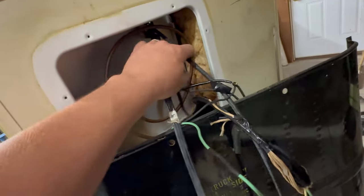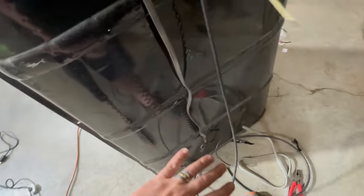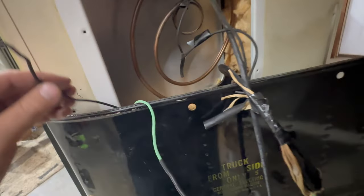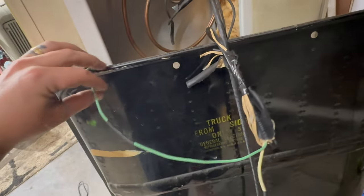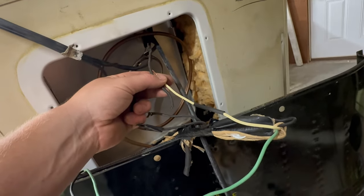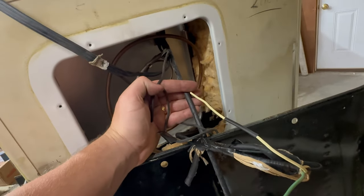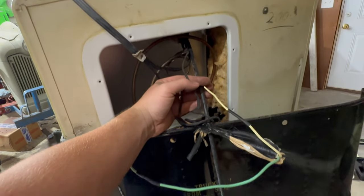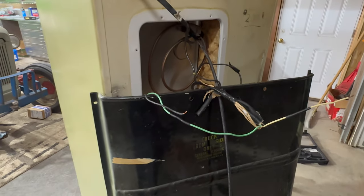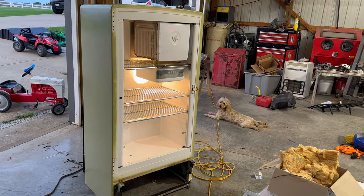So we need to make that happen out of this wire here, and once we get down lower we can put our plug on, our relay, and our compressor. So here's our light — it's wired up one side of the button. This other side of the button is going to be running up into the thermostat, but it's going to actually be attached to our new wire. It's really hard for me to film it with one hand and show you guys while pulling the wiring diagram up, so I'm trying to do the best I can.